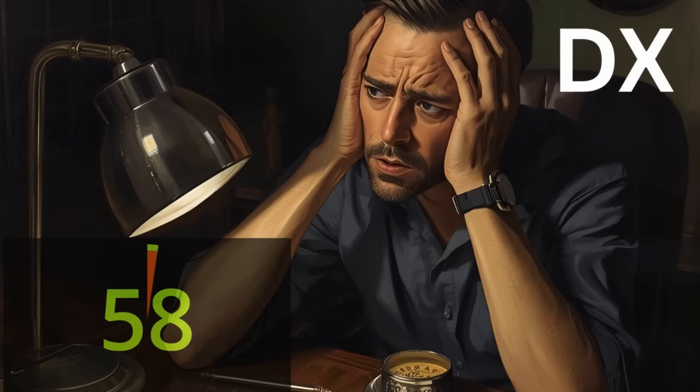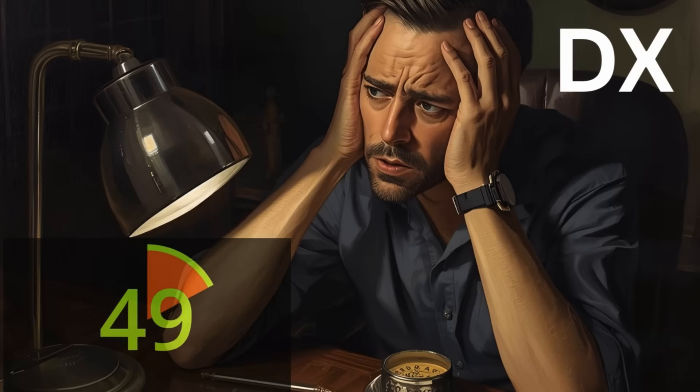Solid-state amplifiers are great - switch them on and they're ready to go, no tuning required, provided they're seeing a low impedance. But with a random wire antenna you're not going to see a low impedance - the VSWR is going to go up and down. With a valve amplifier, the chances are you'll be able to get on bands you couldn't otherwise get on. The downside of a valve amplifier is it takes about three or four minutes to warm up, and you have to adjust the tuning band by band. But the advantage it has in delivering power to a random wire antenna is indisputable.